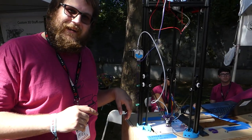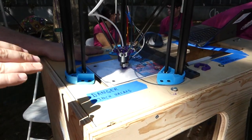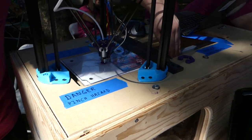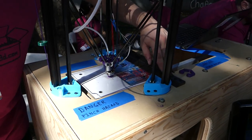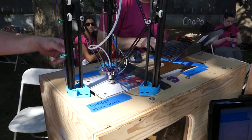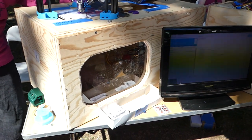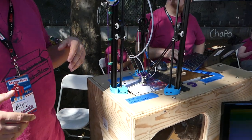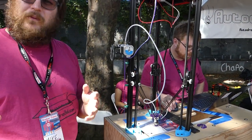I'm Mike with AutoDrop 3D. Right here we have a 3D printer which has an automatic ejection system. We have a build plate which is connected to a linear actuator. It pulls the build plate back against the stationary blade which cuts the item off the print bed. When it's completed, it drops into the box below and then it goes and fetches a new print from the server. It all runs — it's all open source.